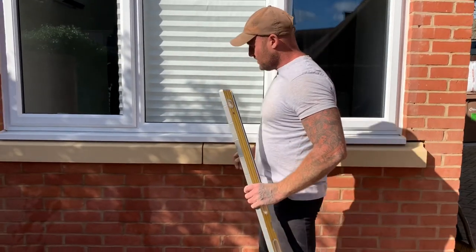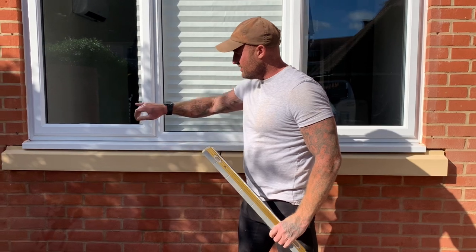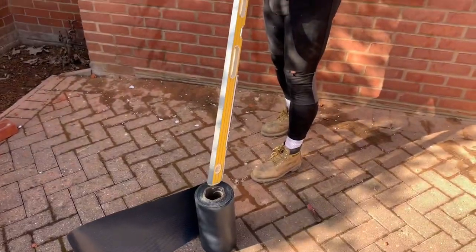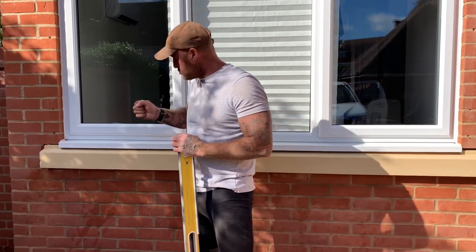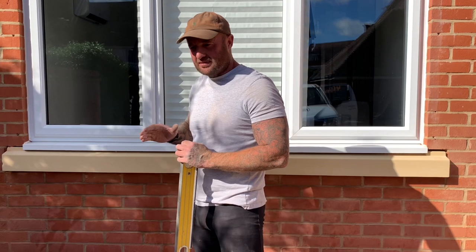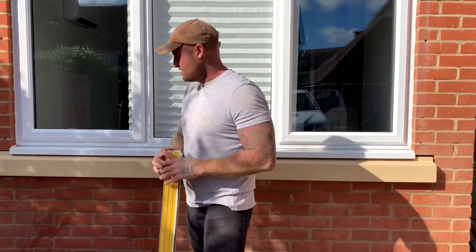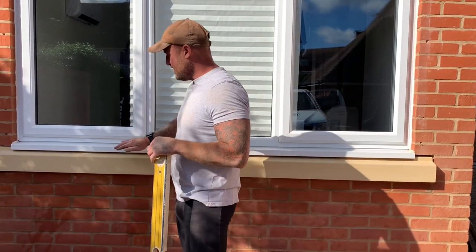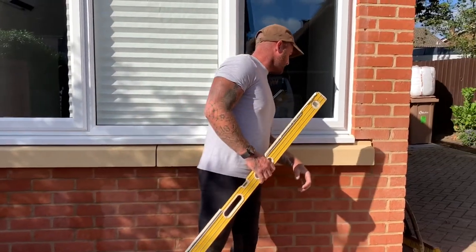It's not too bad — it's all right. So what I'm going to do now is get some really dry muck and really absorb and push some right in and around the horns. Also — always tray-damp the seals. We've got the damp coming in and up. Because the work's built inside, what I've done is screwed it to the internal blockwork — this will stop any water and moisture coming in. Remember, tray-damp or damp-proof course doesn't stop damp — it helps prevent it. It's not 100% proof. I know I've pierced the damp through the screws but it's better than nothing. So tray-damp wraps in and up — she's dry-packed, she's done. Got a nice little joint to fill in, so we'll get some muck knocked up and give it a go.